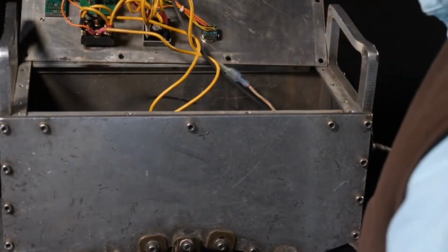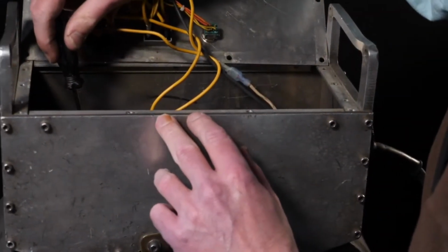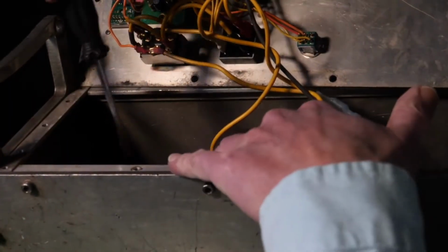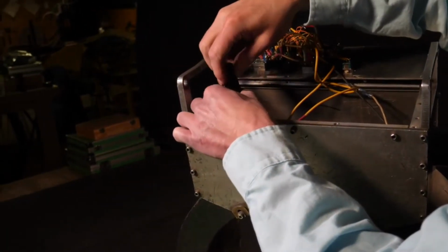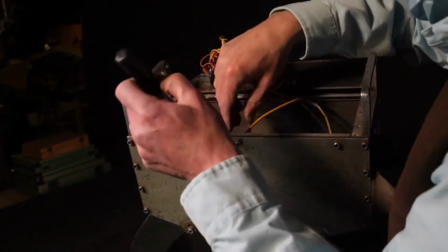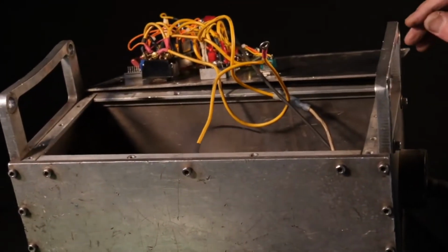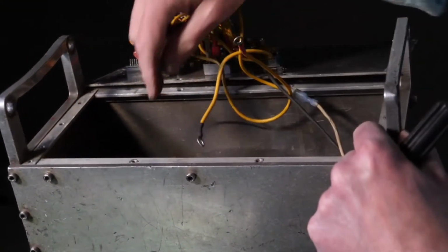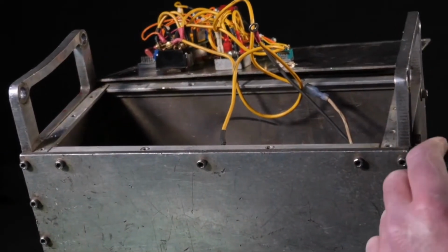So we'll get our handy dandy slot screwdriver and start pulling them out. There we are, 1 brass screw. Now the second one. And now, after many attempts, the second screw can come out again. Don't drop it, it's non-magnetic. Oh, stayed in its connector, good. Now in this type of coil, we're going to have to remember which is positive and which is negative. I remember the red one was over to my left, black one to the right. So when we put the new one back in, we'll make sure we get it the right way.